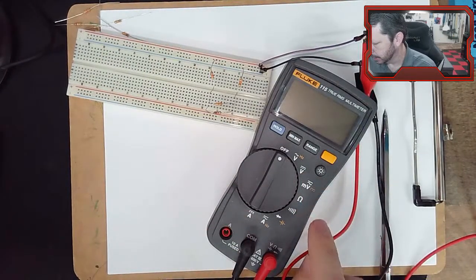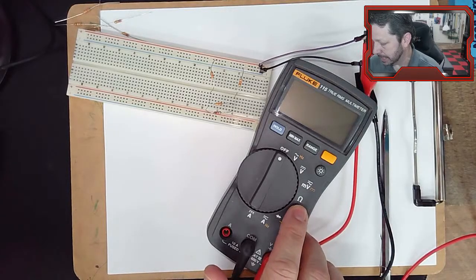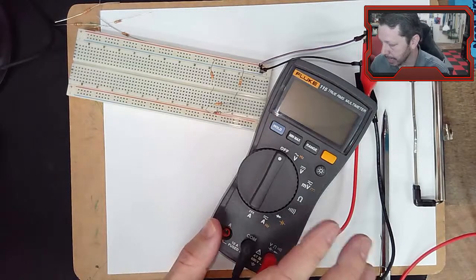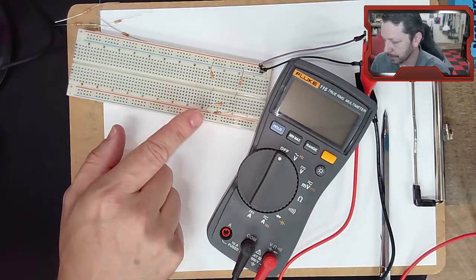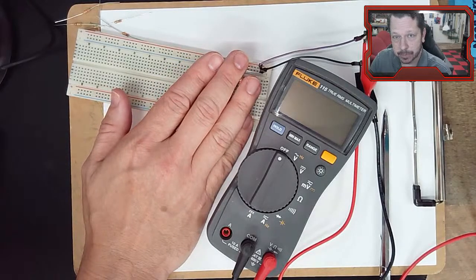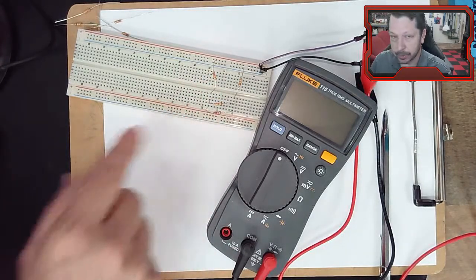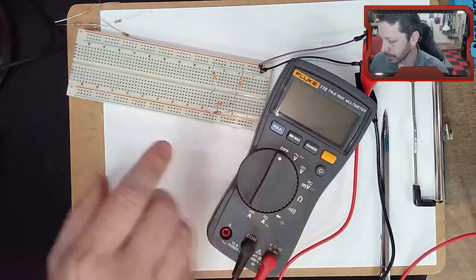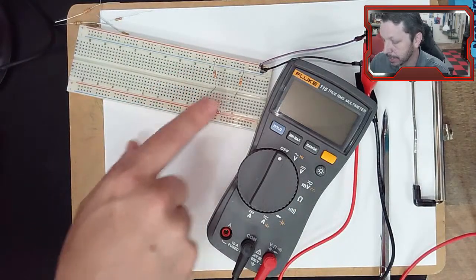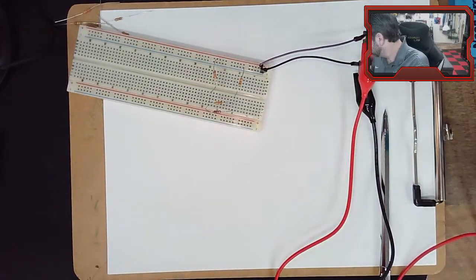Mainly, we're not going to do many current measurements. We're going to do voltage measurements, which are pretty straightforward. But we'll also do resistance measurements, which are mostly straightforward, except you can fool yourself when you are measuring in the circuit itself. The power has to be removed from the circuit, and you have to be sure of what equivalent resistance you're actually measuring: are you measuring this resistor, or the combination of these two resistors or whatever. So I just wanted to show you those things with this.